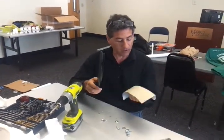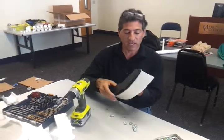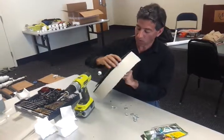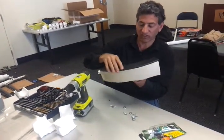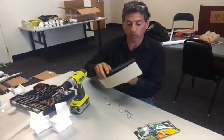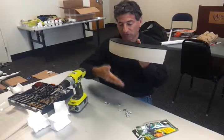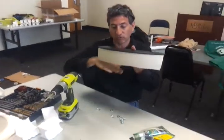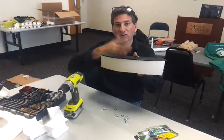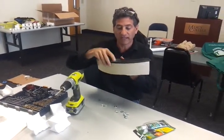Normally, when you buy a polyethylene water tank, either they have very wide threads to screw the lid on, or they have just this slip top, which we have simulated here. Neither one holds water or gas. They're made as tanks for water under gravity to fall, and people are putting them under pressure so the water doesn't leak out. The caps are usually just to keep dust and dirt from getting into the water in the water tank.